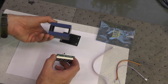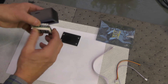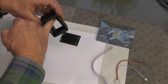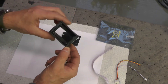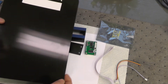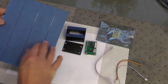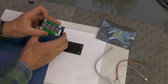This is it, actually. There's the front, so the display will peek through like that from the inside, and it fits just comfortably into the inside. I've epoxied four 4-40 nuts on the inside of the box. I made this box out of plastic that I obtained from clipboards — two cheap plastic glossy clipboards — and one of them I started to cut apart and lay out the size that I wanted. I wanted it just big enough to hold this display, no larger. I wanted to keep the form factor quite small.